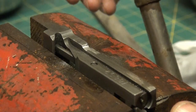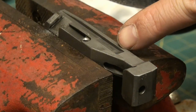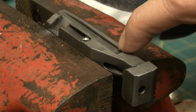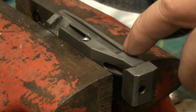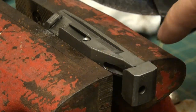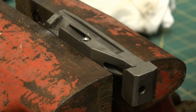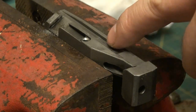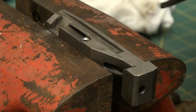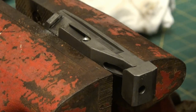Let's turn it over and see what happens. Once I turn it around I realize that using a round file right here to make this edge probably is not going to work — there's nowhere for me to grind that way on it. So I'll have to figure out the best approach once I get there. I'll start grinding this one down again — we're grinding it right to this edge, right to the shelf, nice and even. And then that will free up where the teeth go in the magazine.